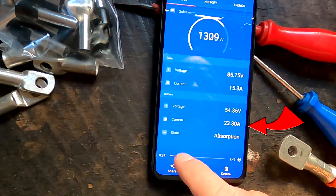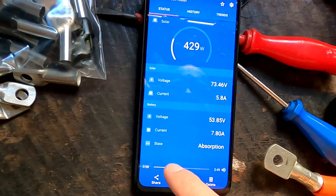Looking at the current going into the battery — only 7.8 amps. If I program a tail current of 10 amps and we're down to 7.8 amps, the solar charge controller thinks the battery is full and switches to float — which is totally wrong because the battery isn't nearly full. These two trigger points — absorption time and tail current — are unfortunately not precise enough. Even though the Victron Smart Shunt and the Victron solar charge controllers form a Bluetooth network and talk to each other for voltage compensation, the Smart Shunt does not submit state of charge to the solar charge controllers, which I think is a significant limitation.